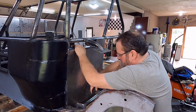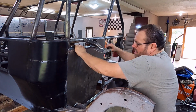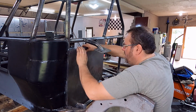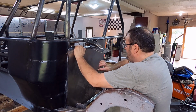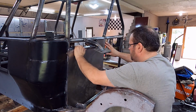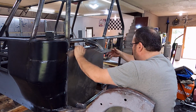And so this is my 20 gauge going in. So we prepped it all the way around. We're going to put it up there and MIG it in as well. And I know it's only 20 gauge steel, but it acts like a gusset as well on all of these corners and stuff. And of course, the thicker it is, the more it's going to act like a gusset.